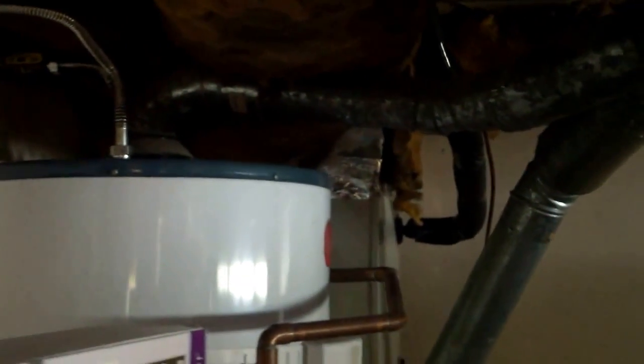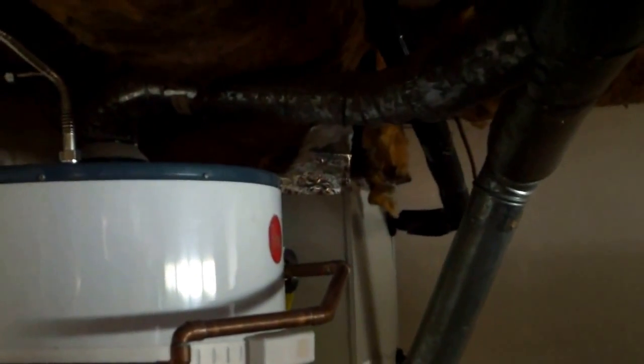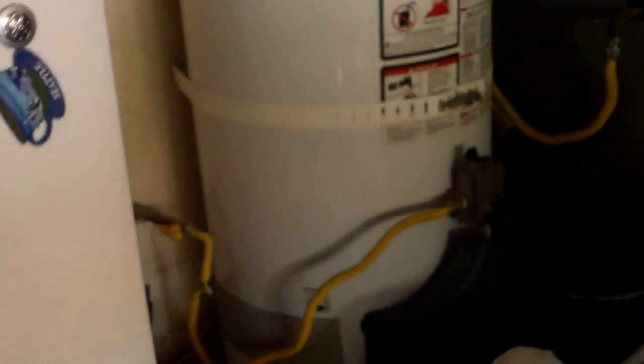So the vent, the furnace, that's probably the original furnace vent, and then you can see that it actually goes down a little bit as well. And that's not something that you want. And what they probably should have done is just had this vent come all the way up here between these big ducts, and then tie in here or something. He thought it was probably because the water heater before this one, it's a newer water heater, it's 2010. He probably thought it was shorter, so they probably ran out of space up here.